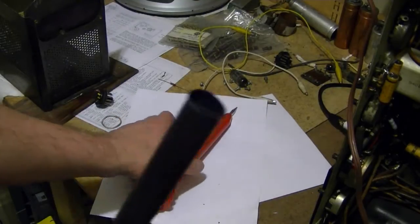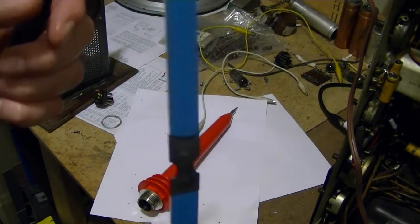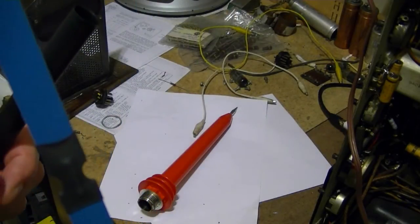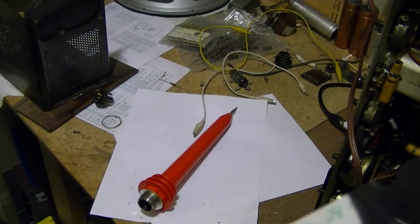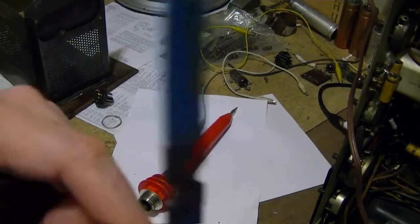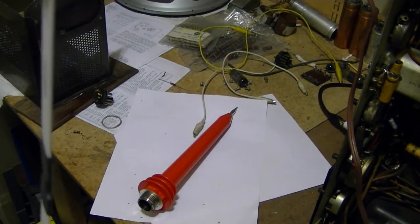So it looks like this is probably a thick film resistor, yeah. Not the kind of thing you can just buy off the shelf anywhere. I wonder if this might be both halves of the voltage divider and in the middle of the junction. Or no, because both leads come out down here. So it's supposed to be both resistors somehow in here. It's like a ceramic substrate and they deposited some type of resistive material on top of it. Oh, don't want to mess with that too much.